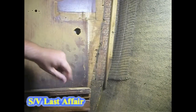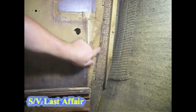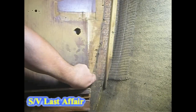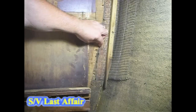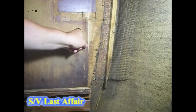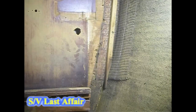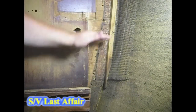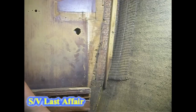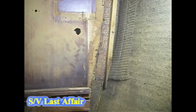However, this is dry rotted, and if we just do a simple little finger test right below the veneer surface, this is soft. I can put my finger in here — I can hear it crunch a little bit. It is completely dry. The veneer face is still on this particular side, as it is on the inside — there's a pantry on the other side of this wall. So what I'm going to do is use penetrating epoxy in an effort to not have to essentially re-scarf in a new wall here. The infected area is from about here down just below the desk surface to about right here, and that's as far as it goes.